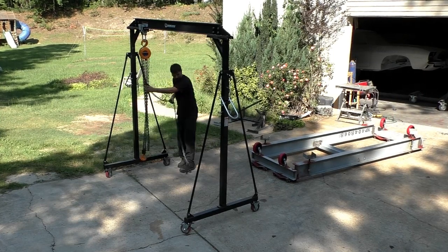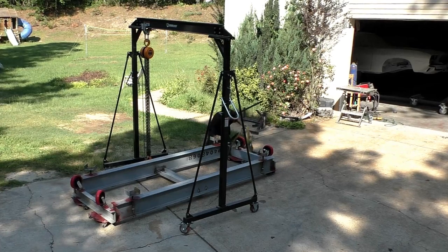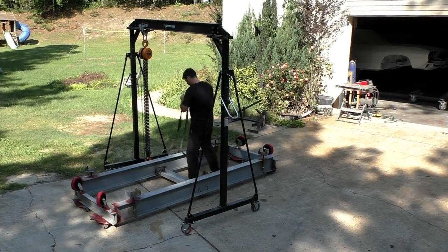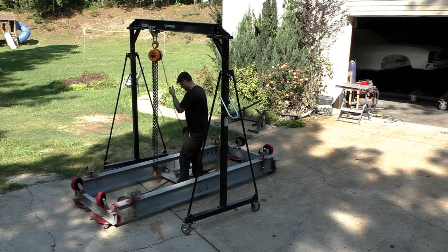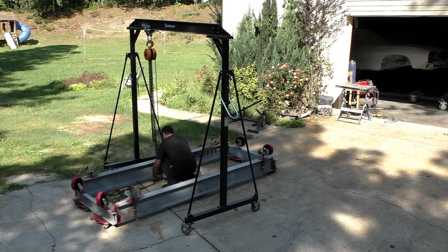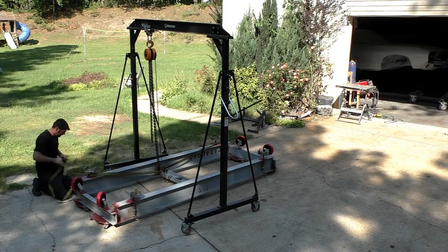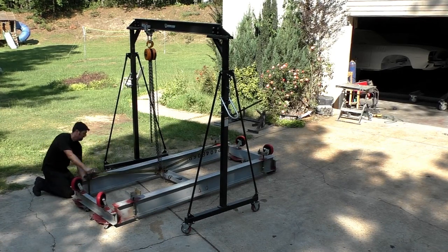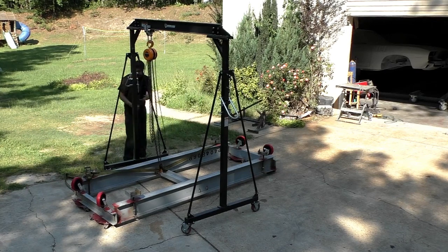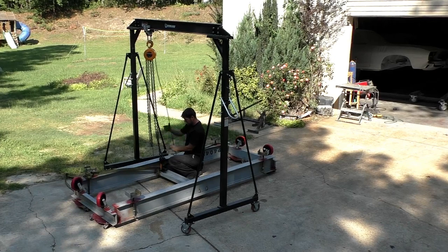We modify these frame jigs as we go along - you see the evolution of it. I do what works best for me. If 6-inch wheels are going to work better for you, put 6-inch wheels on. The 8-inch wheels also hold a little bit more weight, which makes it better for what I'm trying to do. Also with the casters, you can make mounting plates - it seems like the easy route until you bust a caster and have to cut it off. So consider making plates to make your frame jig a lot better.